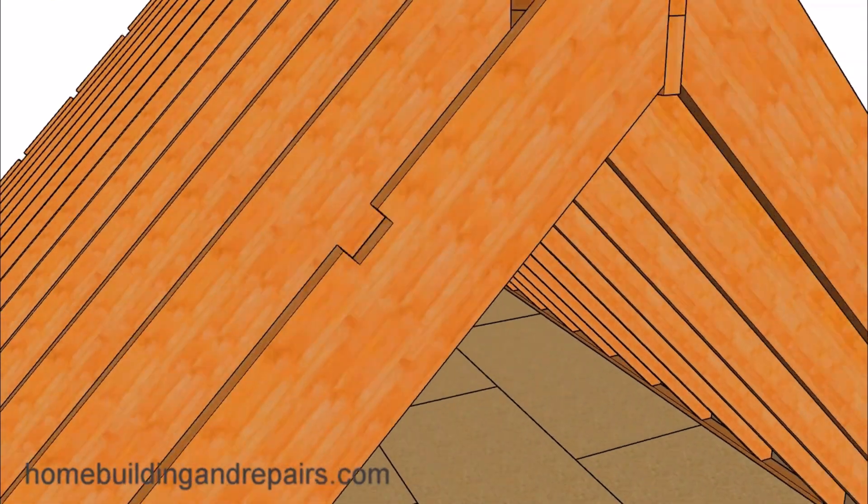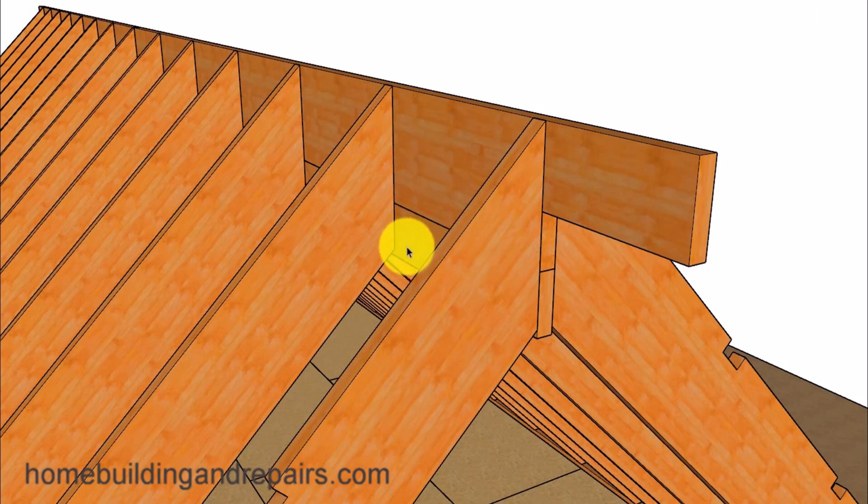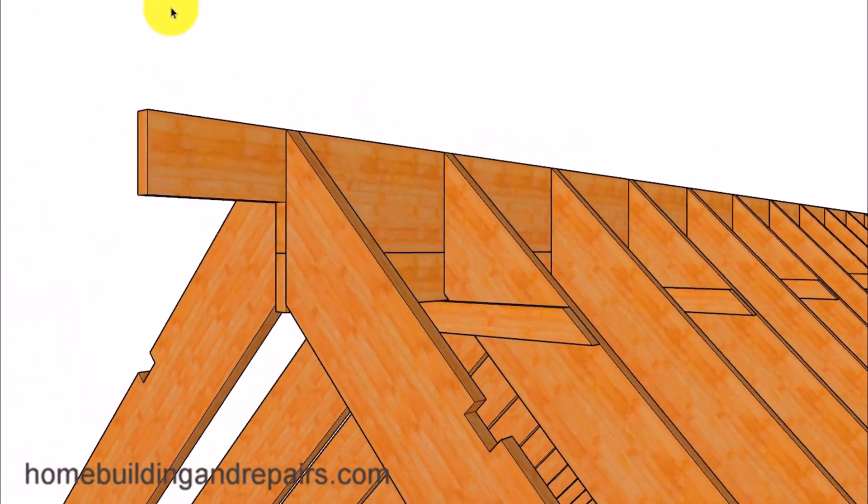At the top, we'll need two boards for our ridge — I'm using a 2x12 and a 2x6, otherwise I would need a 2x16, which might be difficult to find. You could reshape the top board so it won't be hanging down from the fascia board. Our collar ties are spaced 48 inches on center, or every other rafter on 2-foot on-center spacing.